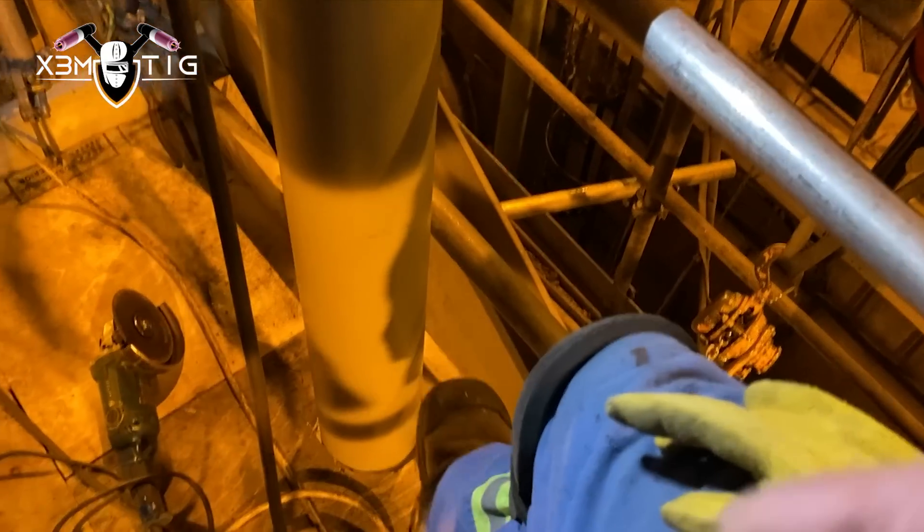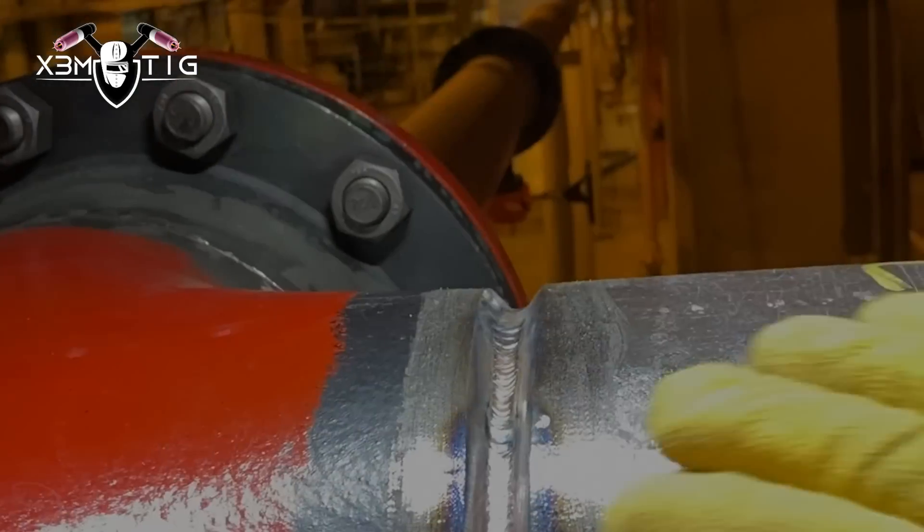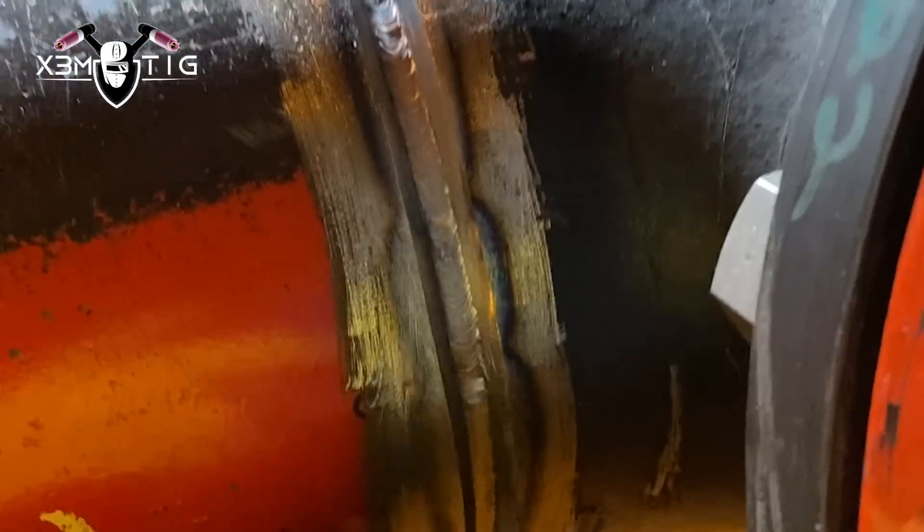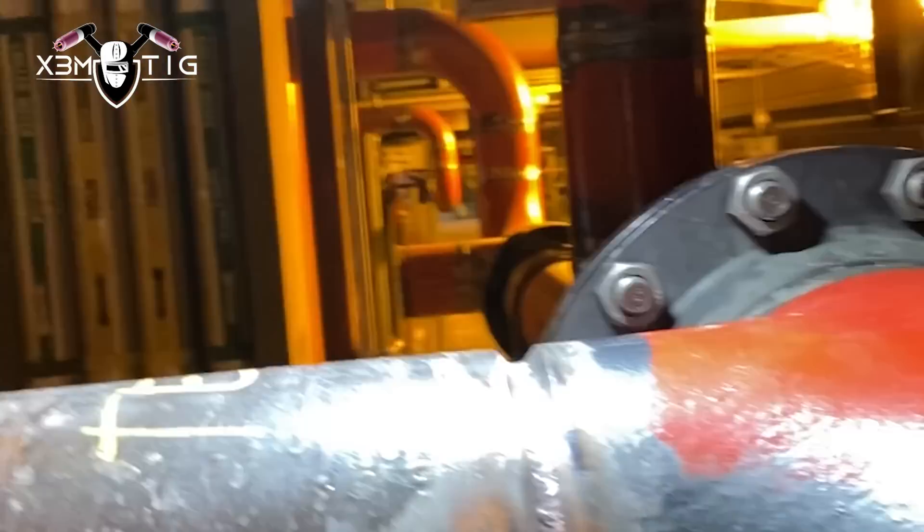Just chilling out and stretching my legs. I'm just gonna finish the tie-in. This is the best I could do from this angle. I dip in the middle, stretch one-two-three, dip in the middle one-two-three — this is how you stretch on the sides, especially on the top. The gravity will do the rest — you don't have to be worried about the buildup inside. You're gonna have nice, lots of protrusion inside. Buffing wheel — clean every pass, every time, before every pass. You don't want any impurities.